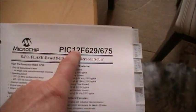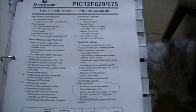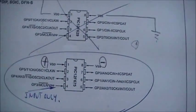But in general, first of all, before you start doing this sort of thing, it's always a good idea to copy out the manual that you can get from Microchip on your processor. In this case, it's a PIC12F675. There's my dog. It's about 139 pages. A lot of material to some, but some of the other chips will have up to 400 pages, and there's a lot of useful information. I usually create little tabs, and the pinout is really important, as well as acquiring information on registers. You know, you're always flipping pages looking for information about how things work.